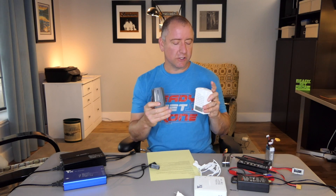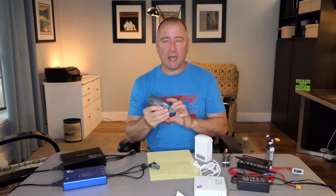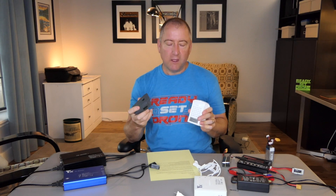That protection board is huge, and it's really important in these DJI batteries because it also allows them to calculate what the return-to-home distance would be. If you have it set to return home automatically when the battery gets too low, it actually calculates the distance and the amount of juice left and says, 'I need this much battery to get back home before I crash.' One other thing the protection board does is actually drain these batteries slightly if they sit for too long. The optimal storage is around 60-65% full. If you fully charge a battery and let it sit for more than 10-20 days, the protection board will actually drain it down to about 65% and leave it there so the cells are stored in optimal condition.